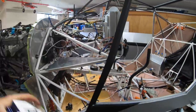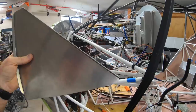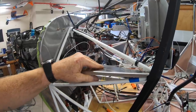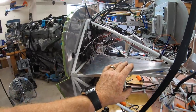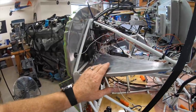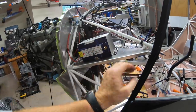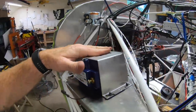I went ahead and made this shelf this morning out of 063 aluminum so it's a little stiffer to carry the weight of the battery box. I had some shells made up from Send Cut Send out of 040, but they'll flex a little bit too much. So I went ahead and made this one out of the thicker aluminum. Four screws go through nut plates on the box itself and then it drops into place — that'll be fastened down, probably hi-lock or clamped, and the battery's all in and done.